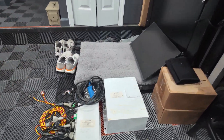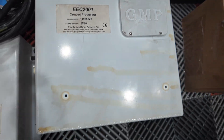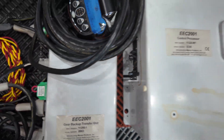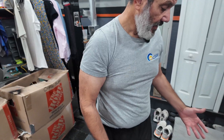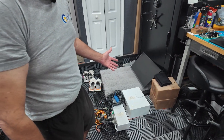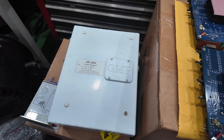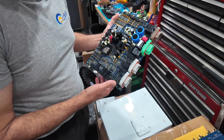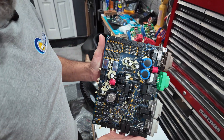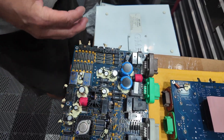Next we've got two EEC 2001s — the first generation of the full electronic control system. The big box is the main processor and the small box is the backup. The first generation never had any throttle output, only shift but no throttle. The customer sent these in: one doesn't even turn on, while the other turns on but cycles like it's not receiving power. We have some boards here that come out of the unit — these are dated and no longer have factory product support.